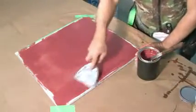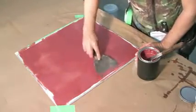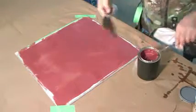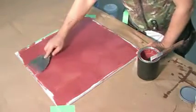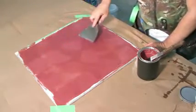Trowel the second coat in a multiple patch pattern overlapping areas. Continue to apply in patches until the whole surface has been coated. This is only one of several methods of installing this product. Another way is to use large wavy strokes with some skip trowel texture and then apply and blend other Glitter Rock Smooth colors into it.